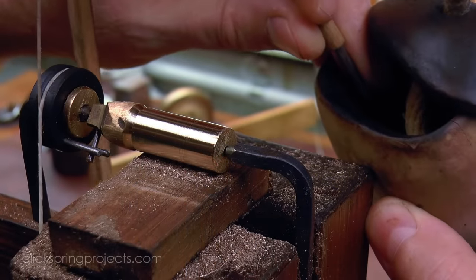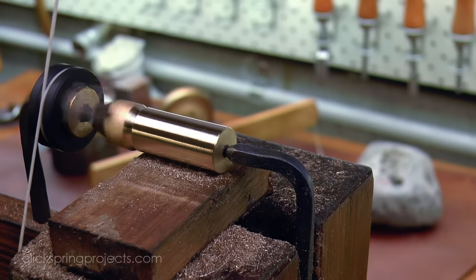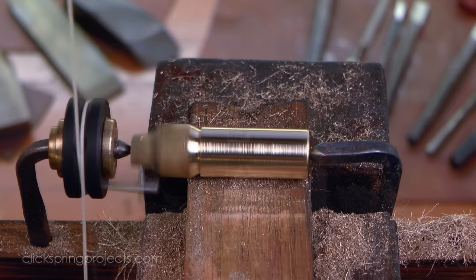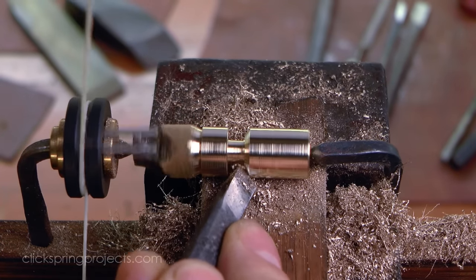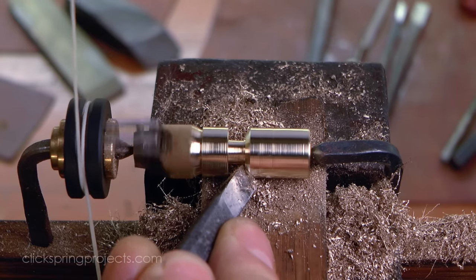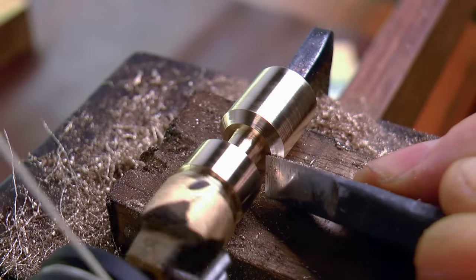An occasional spot of olive oil on the bearing points helps to keep things moving, and the cutting progresses in a way that will be familiar to modern clock and watchmakers, because this is basically a crude version of a watchmaker's turns, the lathe technology used to build the first mechanical clocks and watches, and a precursor of much of what was to come.